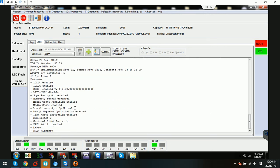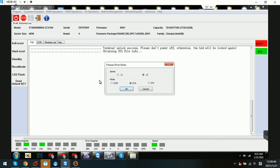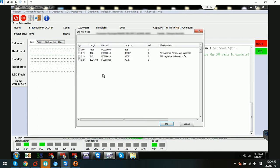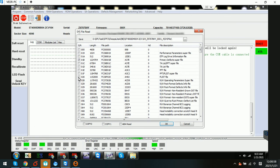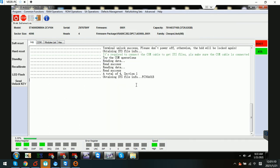Now, since we have access to the firmware area, we can back up the firmware modules. We can read the SYS files: 1B, 28, 35, and we can also select 93. Click OK. The program has started to read the important firmware modules.